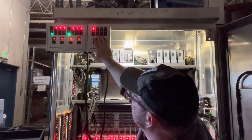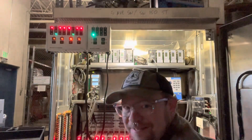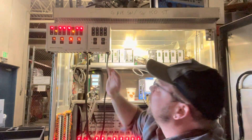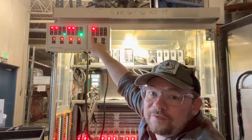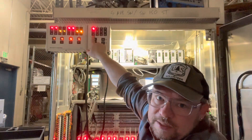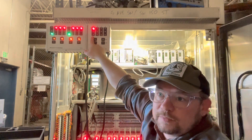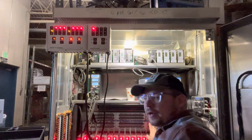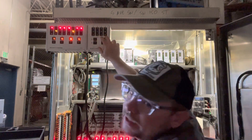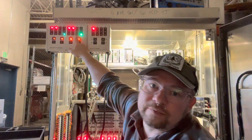And then we have a phase nine. I know this says overlap A, but this is wired into this box. This is actually a phase nine that I've set up — a physical phase nine that I have driving out of the overlap channel. That being said, overlap B and D are my flashing yellow arrows for phases three and seven.